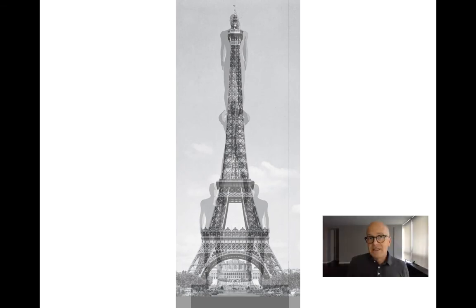We can design without flying buttresses so long as we have a decent footprint at the base, so long as we have ways to build up that resisting moment against the overturning moment that can knock a building over. If you look at a tower like the Eiffel Tower in Paris, it's this beautiful, graceful, intuitive shape. Basically, all Eiffel is doing is making very clear how important this is when we get super tall. The Eiffel Tower is about 900 feet tall.